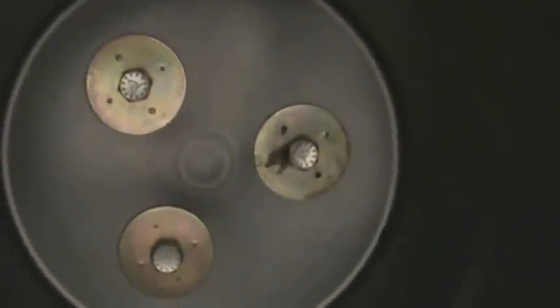What I did here: this is a sanding disc backing plate. I had to machine out the five-eighths inch hole to three-quarter inch for the three-quarter inch shaft on the motor. Half-inch bolts through just three of them, with fender washers to help distribute the load on the bottom of the bucket, and one-inch square tubing with two skateboard wheels on each side to support the front of the bucket.